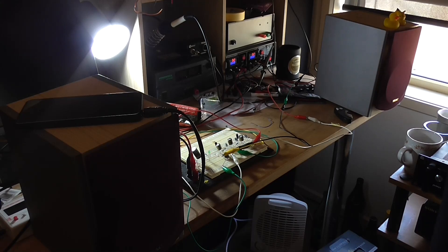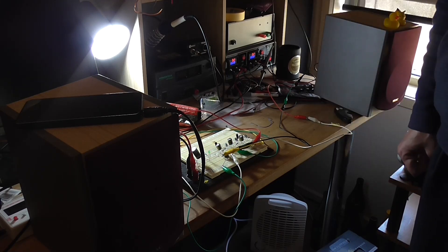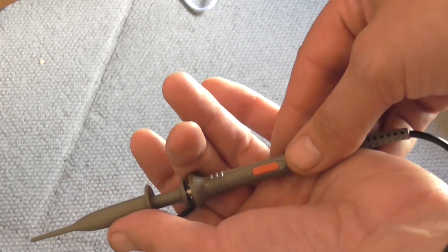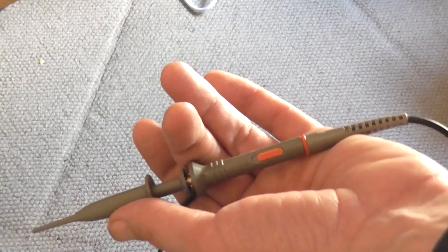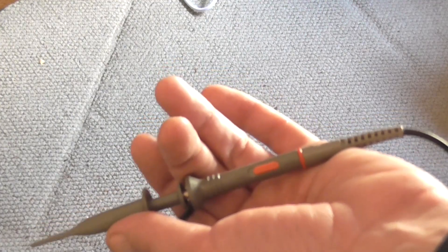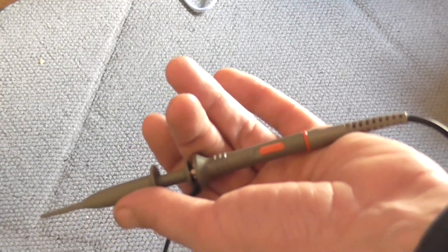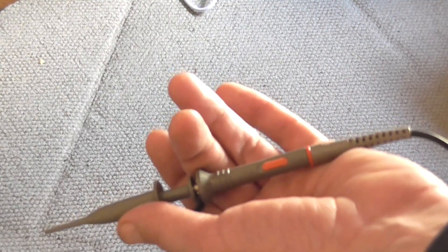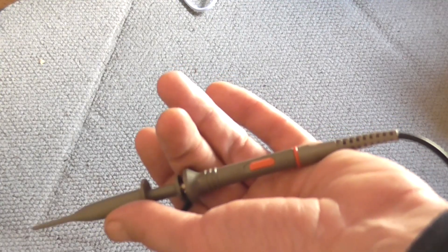Anyhow, I'm going to leave this video here because there's not much more I can do with it. If you enjoyed it, please remember to go down below, like, comment, and subscribe if you haven't done so already. As always, this is the Astro 30 saying see ya — have a great day, I'll see you in the next video. I hope you all had a good Easter. One final piece of advice: if you do a lot of testing in times-one with your probes, always switch them to times-ten when you go to put them away, just in case you connect to something higher than 50 volts DC so you don't blow up your oscilloscope. Anyway, catch you in the next one, thanks for watching.